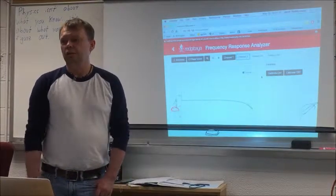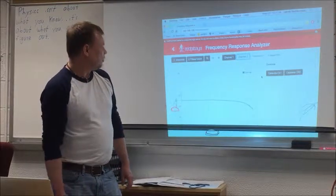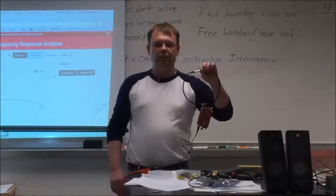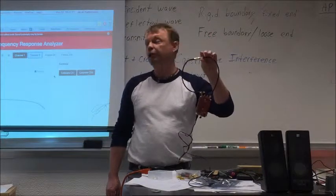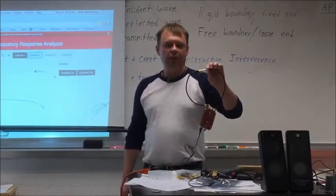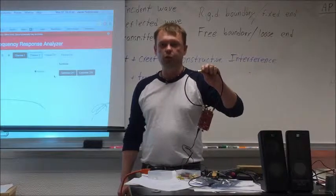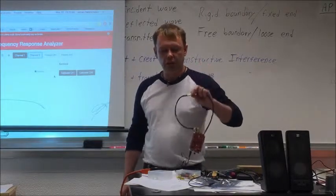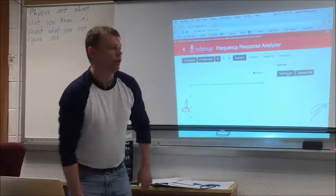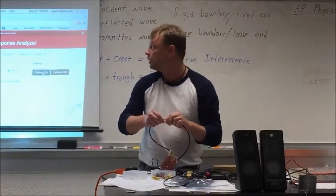So this is what we have. First I have to calibrate it — I connected the input and output with a barrel connector. You can see it's way below zero because I have an attenuator here. If I connect the output from this analyzer directly to the input of the amplifier, it will be way overblown, so I have to attenuate it. Let's bring the signal to zero — it's calibrated nicely at zero.